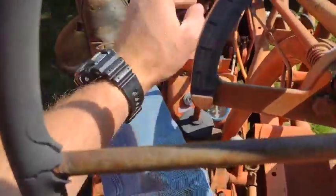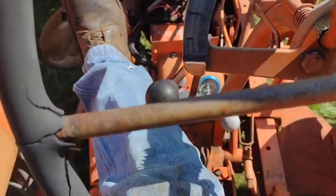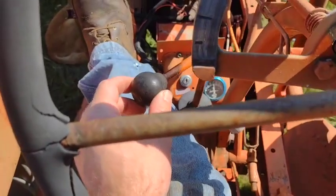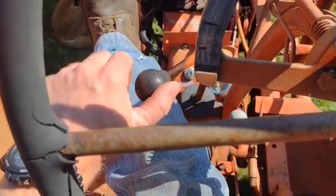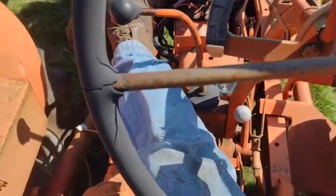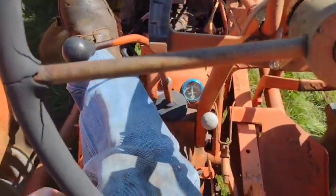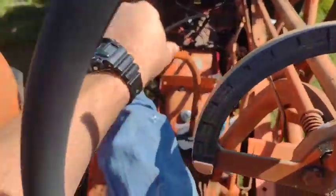Now looking at the transmission on this one - it's honestly not that bad. However, Allis Chalmers did not build the transmissions on these properly, so there's always an insane amount of slop. A lot of the time you check one of these out and move the shifter side to side and it's just clunk clunk clunk - inches of slop. This one goes into three out of five gears. If the tractor is running and driving, ask if it has issues popping out of gear, because a lot of these do. The only way to fix that is to build up some surfaces inside the shifter mechanism, which can be done cheaply but is labor intensive.